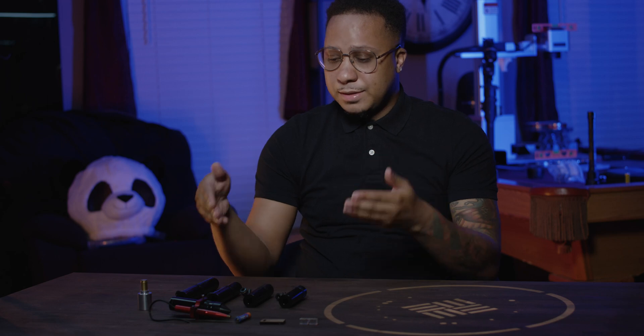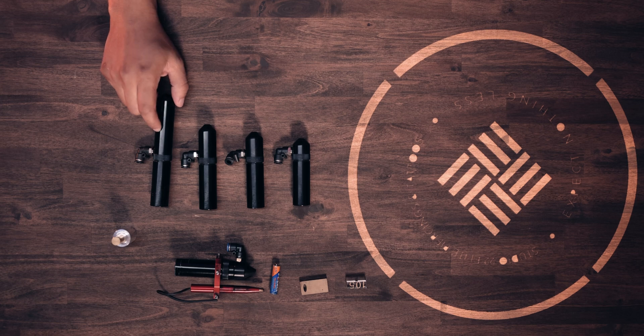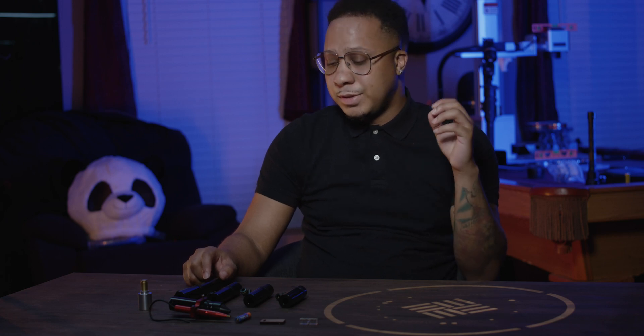Back to the lenses — the 4-inch. I don't really find this necessary in most cases. The only time I find it necessary is if the material is really hard and I want to take out a lot, making sure I get a clean cut all the way through. You do get a much bigger beam with this, but you have to use more power to drive it.